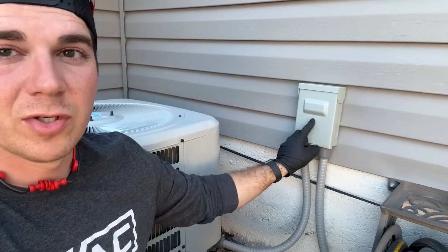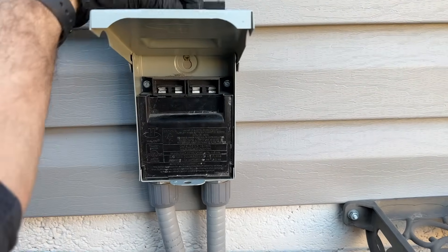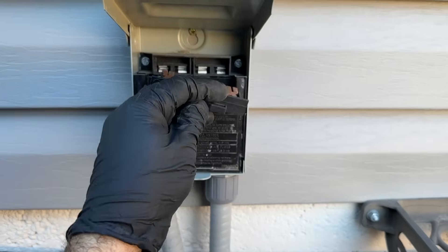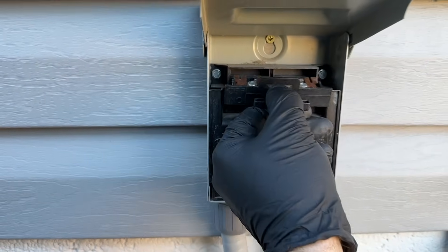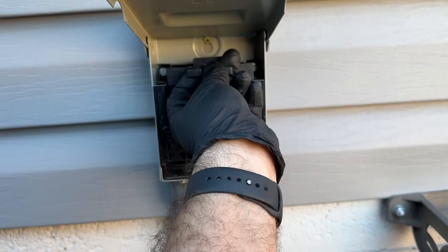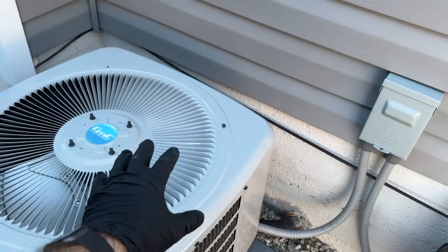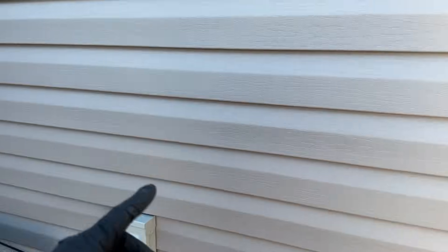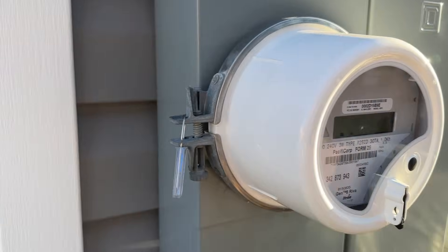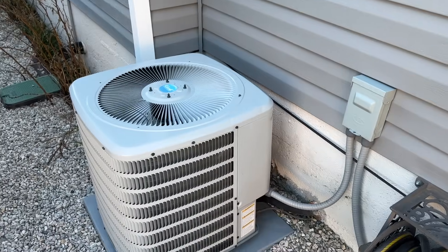Since the unit we're working on isn't physically attached to a home, I'm going to show you on my unit the first thing you need to do — turn off the power. Simply pull the cover up, pull the disconnect out. You can set it on top, or flip it upside down so the off position is on top, which acts as a storage position without connecting power. If your AC is close to your breaker box, it may be on its own breaker — just flip that to the off position and power is shut off to the unit.